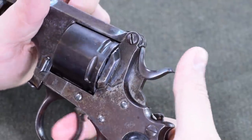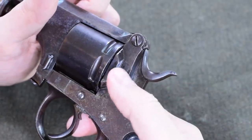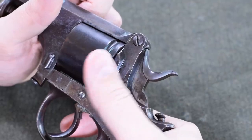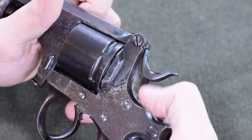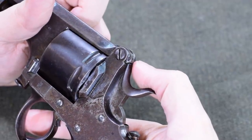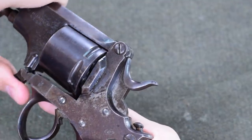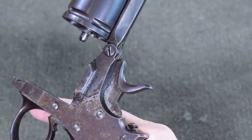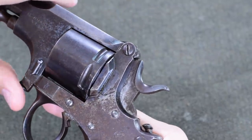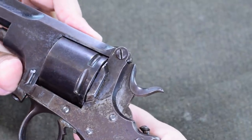Since this gun has to open up, there was a desire to prevent you from closing the gun on the hammer — because if you don't rebound the hammer, you fill this up with ammo and snap it back closed, you may drop right on a live firing pin. So if you pay close attention, you'll see the hinge is actually shaped over the top of the hammer a little bit. As we open this, it cams the hammer back to that rebounded position, so when we close the gun, we have no fear of striking the firing pin as we load. That's a very smart little thing.